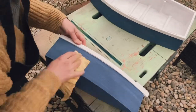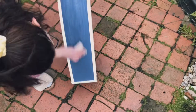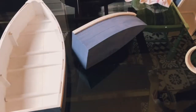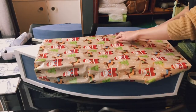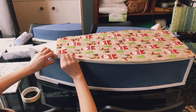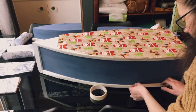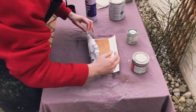The blue paint has dried a bit streaky and bumpy — I'm not completely satisfied with that finish. So I'm giving it all a sand over to smooth out any brush marks, and I'm actually going to spray a coat of paint over the top to get it a bit smoother. Because I've already painted the white and done a couple of coats, I really don't want to get the blue spray all over it, so I'm going to have to mask that really well using some old Christmas wrapping paper.